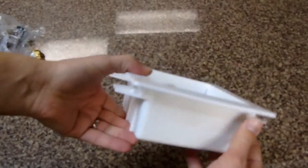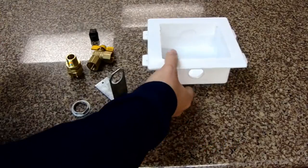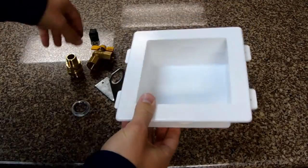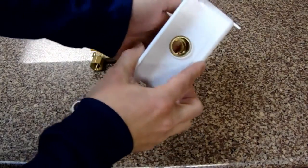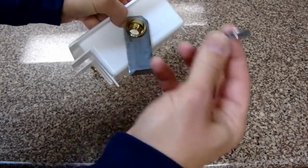Here's the box. Mounting points are on the side and the hole is on the bottom. Make sure the gas supply is turned off before install. Starting with the GasTite XR3 fitting, insert it through the bottom of the box, then attach the mounting bracket with the supplied nut.